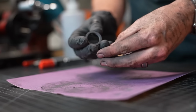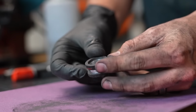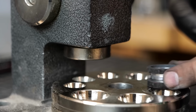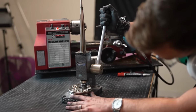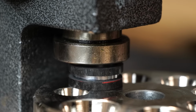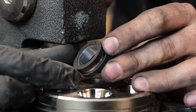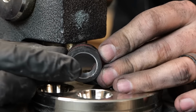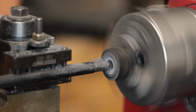All right, these three pieces are ready to get combined together. We're going to use a method called press fitting for this. So we're getting the three pieces all lined up. You'll notice they don't squish together on their own. We need to use some mechanical pressing action in order to literally shove them all together. That makes sure that we've got a really nice tight fit with everything, and it actually doesn't require any glue to hold it together. All right, we're getting really close.